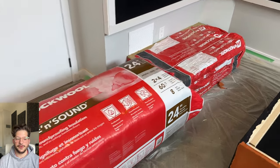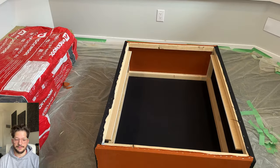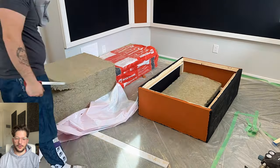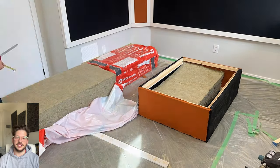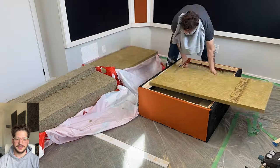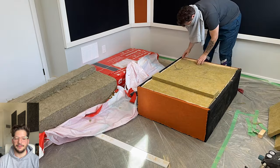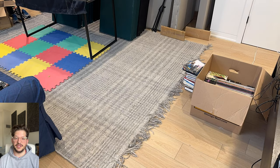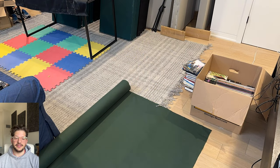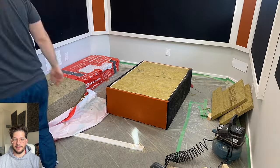Here is the insulation we're going to be using. Before we insulate the front face, we're going to get all of the insulation inside these traps. The first insulation going in is the softer Rockwool Safe and Sound — it comes in 24 by 48 inch, 3 inches thick, and we're doing three layers, cut to size to fit in. For the front face we're using the Rockwool Comfort Board 80, cut to size so it rests on those little pieces nailed into the frame. That way if you push on the bass trap, the insulation isn't going to pop inside — it stays on the front face right behind the fabric.